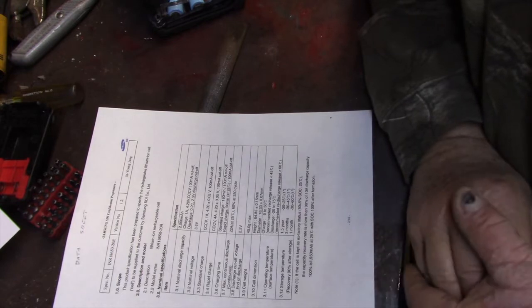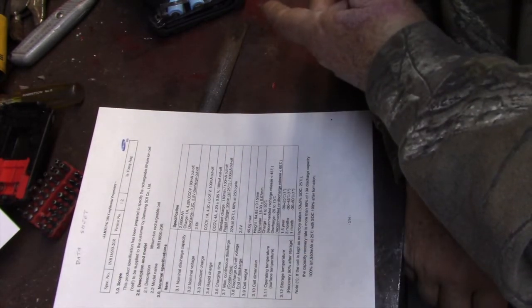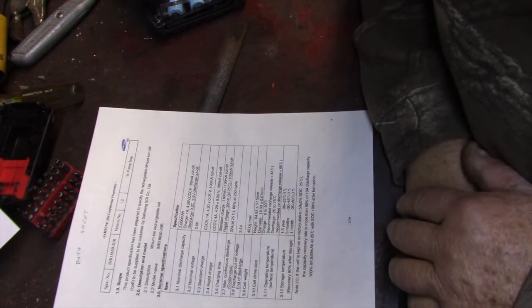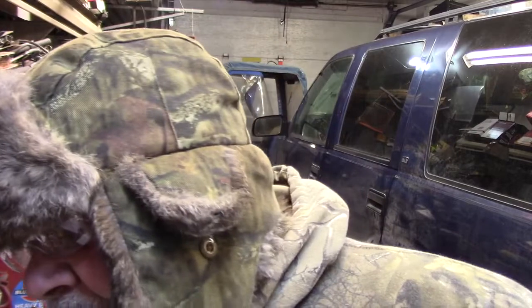That's about it. It's more or less what I wanted to tell you: these batteries, specifically this Samsung 20R, like temperatures below 25 degrees C. So you don't put that in a shed where it gets to 40 degrees C in the summer, because you're ruining the battery. That battery is deteriorating with time.